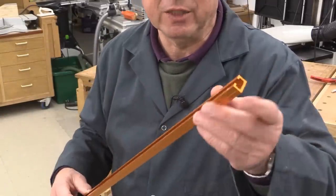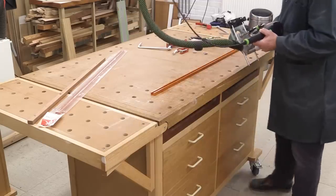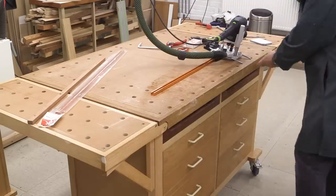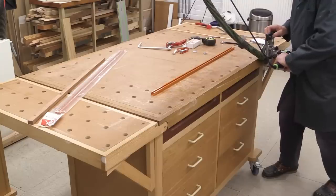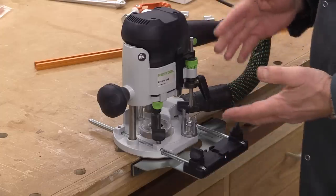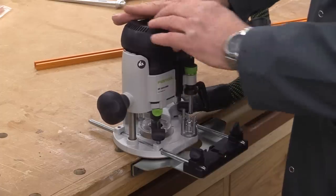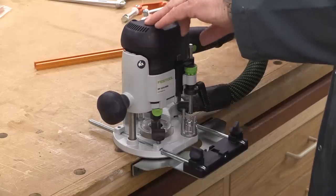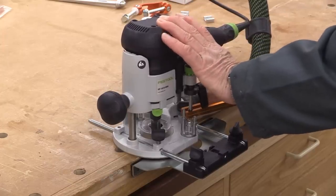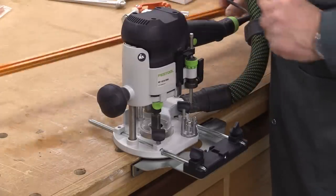The best way to fit this is to create a channel which will just take this so that the front face is flush with the surface. When you're doing this, you've got to remember which way to go with the router — that's the edge I'm guided from. I'm going to set the final depth. This relies on the router being put on a flat surface and lowering the router down so the tip of the cutter is touching the flat surface. Then you put something under here which represents the depth you want to cut — in this case, the actual material — and then lock that off. So that depth is now set to the exact depth of this extrusion.